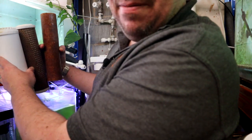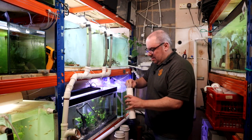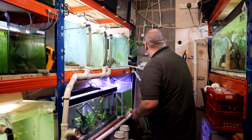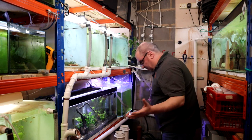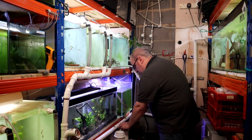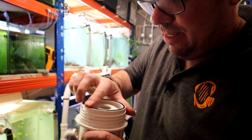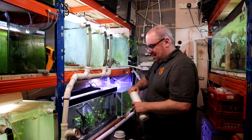Think how nice and happy the fish will be. It's really just a case of swapping them over — getting them out, dropping the new ones in, and screwing it back. Just get them all hand-tight. One other thing I always like to do is check the O-rings, because that's when you start to get leaks. They all look quite good — I changed them about a year ago so I'm expecting them to last a while. Then in goes the carbon granules.